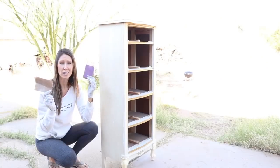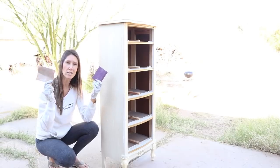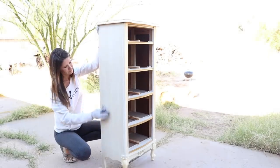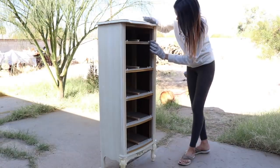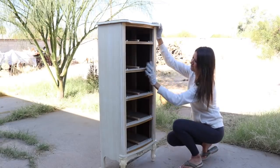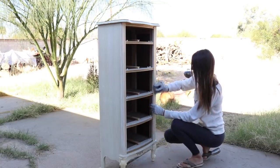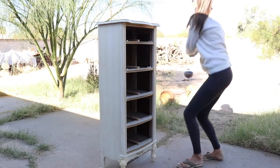Okay, first step is sanding. I tried the sanding block which is 120 grit — a little bit coarser — and then I tried the finer 220 grit, and I think I like the 120 grit sanding block best. Our goal with sanding is not to strip it down to bare wood — it's just to strip away that extra slickness and shine and give it a little bit of fine texture, just enough to ensure the best chance of adhesion when priming and painting. You can also sand away any nicks, slight scratches, or dents.